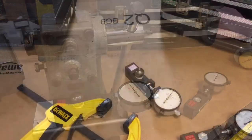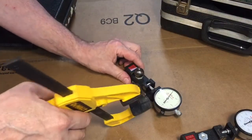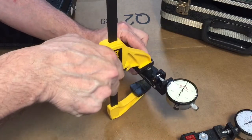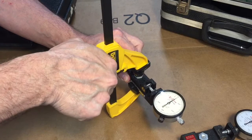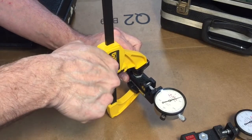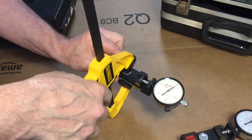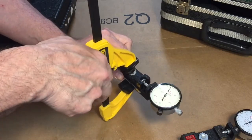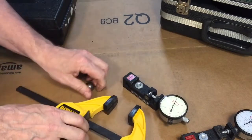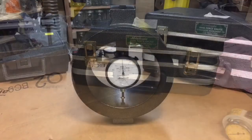Let's see some more demonstrations. Let's say you wanted to check your clamps to see if they were slipping, or compare them to see if they're wearing out. You take a clamp like this, place it over the force gauge, press down, and you can see you get about 60 pounds of pressure — you can see that right on the gauge. These are compact clamps for any type of use. Now let's take the big Morehouse out and see what we can do with that one.